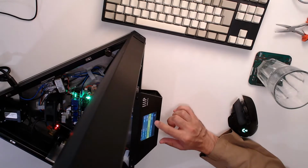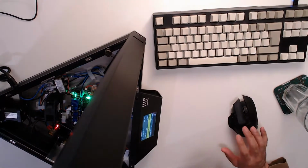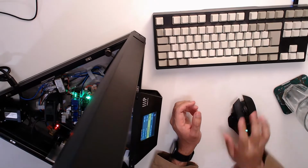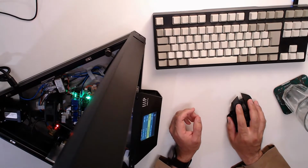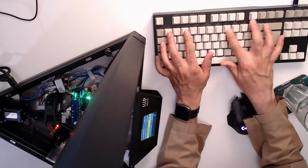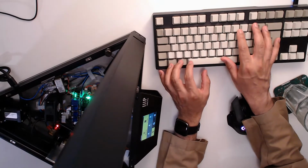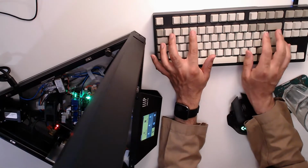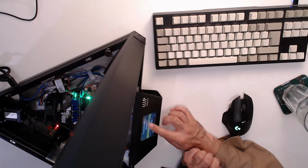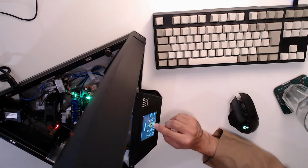And then the extruder axis, which I kind of had to work out by a bit of trial and error when I upgraded the extruder with a geared one, and it went up massively because the gear ratio is 3:1, but then the input gear was different as well, so I think it was about 4 times the amount it was before. It's currently 3,180. Divide that by 4. This driver actually is the one that I modified on the soldering stream to put it in the more powerful, less silent mode. So 3,180 divided by 4 is 795. I'll need to retune this, and it'll be easier because the numbers are a bit smaller this time.